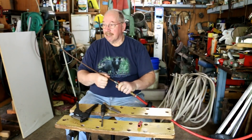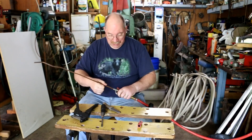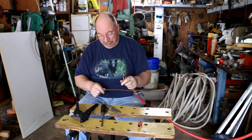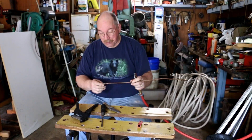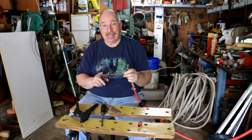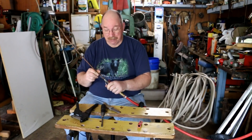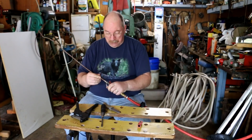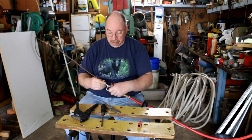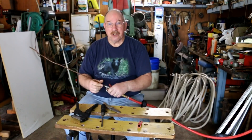You'll notice this copper line I've got on the end. If I had this in a factory, they would go ballistic. OSHA says you absolutely cannot have a line that doesn't have a bleed-off on it. Why is that? There's a good reason — people are stupid. Not you, just people in general. There's always some clown that likes to goose people with a hose.